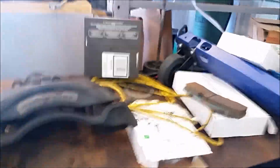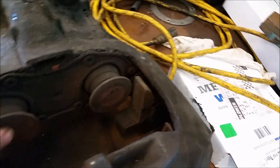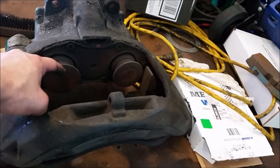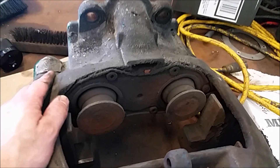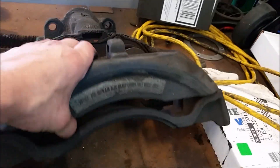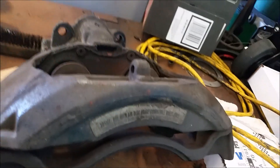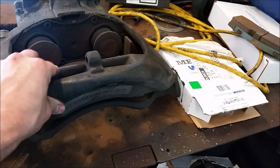Here's the rotor caliper — it's a really big caliper. You've got your air can that sets on back here and actuates the pistons. The pistons wound up seizing in this particular one, and on this model it's not a rebuildable item unfortunately. This thing is also heavy — the better part of 80 or so pounds. This is a Bendix dual piston. The seizure caused the damage, which took out the brake pad, so we installed new brakes on the front right drive axle.